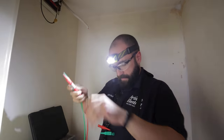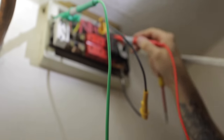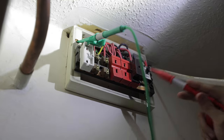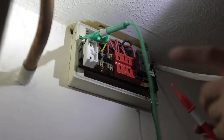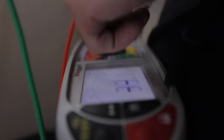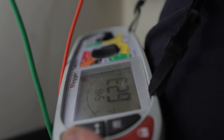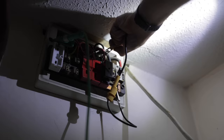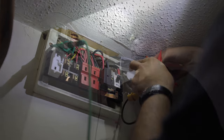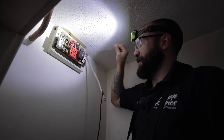I'm trying to do an insulation resistance test and I'm getting a very low reading. I've linked the live and the neutrals together to test to earth, so it means one of the other circuits is interfering neutral to earth. The only way I can test this circuit individually is to remove its neutral to prove it's not that circuit. That's whacking right around now - I'll put it on 500. I normally do it for about five seconds but I think that will go clear. One circuit's IR done - now I'll pop it back together, liven it up, and get our Zs test. Being careful not to touch that bar - I'm 100% going to get a belt today.